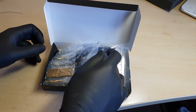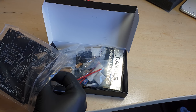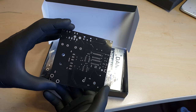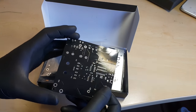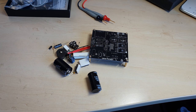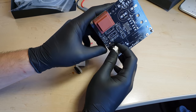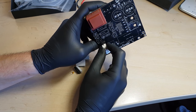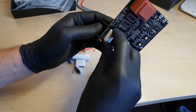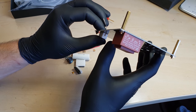Now to the much more important main device. The high voltage driver board will not be visible later, so it doesn't matter how it looks — thought the guys at OneTesla, who proceeded to squeeze it into a bag with another board. During shipping that caused some superficial scratching on the glossy black finish. They have supplied some very good quality Cornell Dubilier electrolytic caps — a good choice, because these will store rectified mains voltage later. As much as I enjoy making fun of their design choices, like this oversized resistor, I'd like to take a moment to appreciate their clever schematic. The kit itself doesn't encourage learning or understanding at all; it's a purely mechanical step-by-step assembly guide.